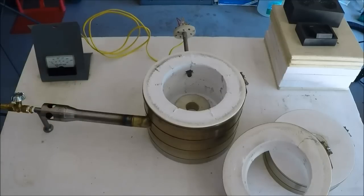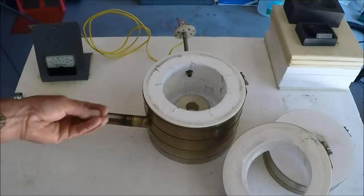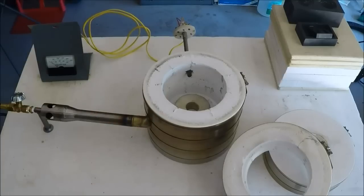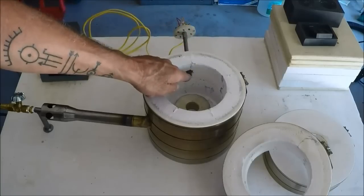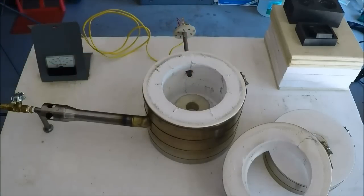When the burner is operating properly it will get hot about to here — which is discolored — but back here you can actually touch it; it remains at room temperature because of the propane and atmosphere going through it. We have our pyrometer inside, exposed approximately a half of an inch. The pyrometer is measuring the temperature of the flame, so it immediately registers that temperature. There's a little bit of lag time for the kiln itself to warm up to that temperature, but not very much.